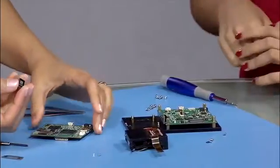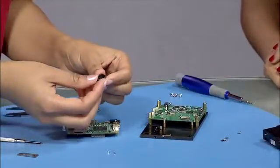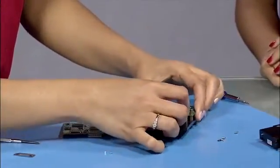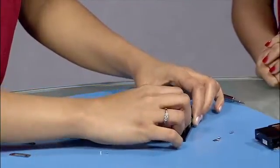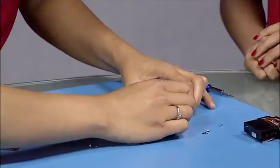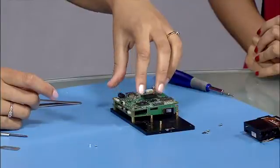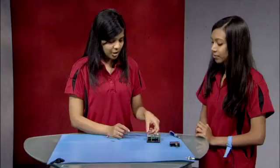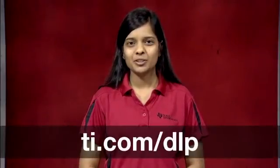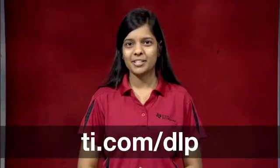Keep the light engine aside. When you look at the adapter board, take the DMD — the triangular notch on the DMD should be towards the right. Carefully insert the DMD back into the adapter board, making sure the orientation is correct. You can then connect the systems board back. Most customers would like to flip the systems board and driver board 180 degrees so you can have the optics on the other side. Thanks for watching — please visit the Solutions and Services tab on TI.com/DLP to find out more about third-party accessories and flex cables. Thank you.